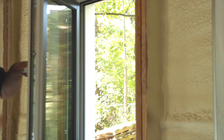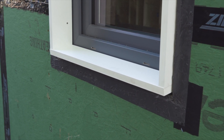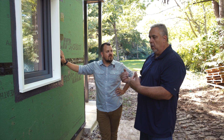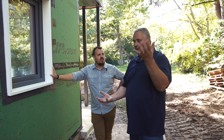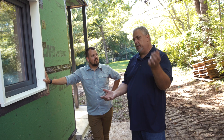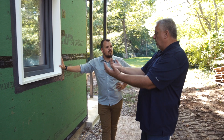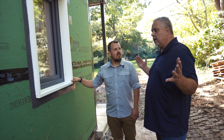The most dangerous thing about a caulk joint is you shouldn't ask 'what am I keeping out?' — ask 'what am I keeping in?' Nobody can do a caulk joint that will keep water out for its entire life. It's going to find failure at some point, and moisture will get behind it. Water management means it's okay if things get wet, as long as they dry more than they get wet. It's when things stay wet and can't dry that we run into problems. By creating a barrier system you trap water behind it. That eighth-inch joint lets water in, but it lets water out — and we have a sloped sill underneath, so the water goes in and comes out. It's a fully water managed system set for years of success.